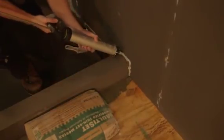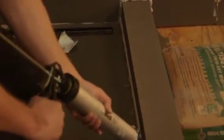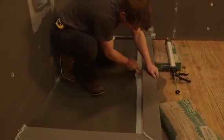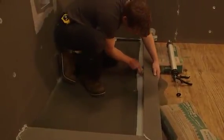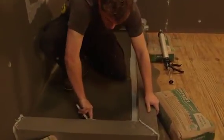To finalize proper waterproofing and strong seam reinforcement, a second half-inch bead of WEDI joint sealant is topically applied over all seams in the entire assembly and troweled flat using a WEDI corner putty knife or a regular flat putty knife. All seams should be covered with 1.5 to 2 inches of solid joint sealant centered over the seam. Make sure the joint sealant coverage is solid and uniform, but also flat, leaving no areas of buildup, as these will bother you when setting tile.